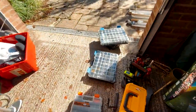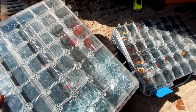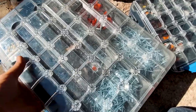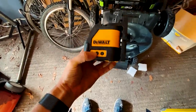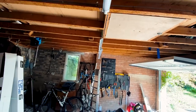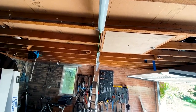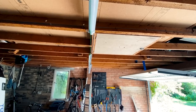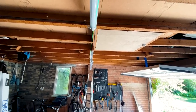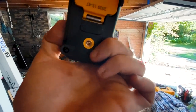The other thing I wanted to mention is my DeWalt line laser — I've just made a video about this on my Tools for Sparks channel. It's a green laser, really really cool. I've just used this to put a line on the ceiling to get my light fittings lined up. I know it's not 100% necessary but it's a nice luxury — it easily allows you to see exactly where to put your screws in. You can mount it on a tripod if you want, but I just pop it on the floor and it gives you a nice line.